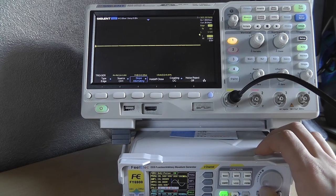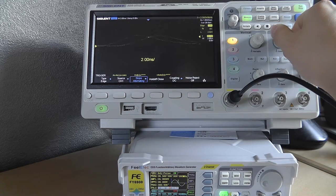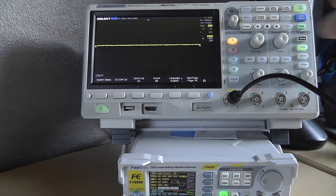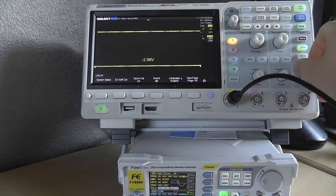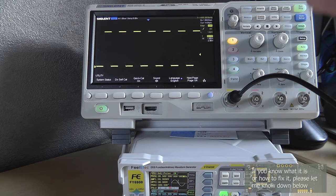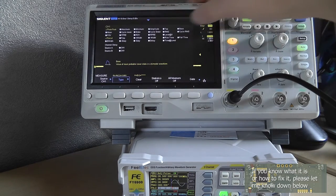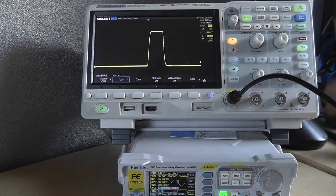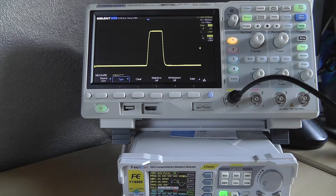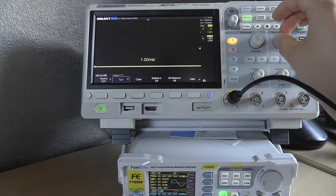The pulses appear but seem blunky, then disappear. Pressing default on the oscilloscope helps — there's some kind of memory bug that's frustrating. This should be a pulse of 100 nanoseconds at 50 nanoseconds per division. It's a little off from the expected amplitude.